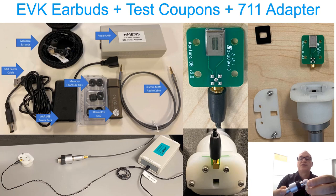If you use comply tips on other earbuds, it's a good indication of insertion depth, though everything might be a little different so adjust accordingly. If you don't believe you're getting a good measurement because you're seeing low-frequency roll-off, it's always good to keep a little putty around to seal around the earbud at the junction where the tip is. Or if the tip isn't working for you at all, you can use putty or wax compound and just insert the earbud into the ear tube, centering it as best as you can — a little less repeatable without a manufactured tip, but it's possible.